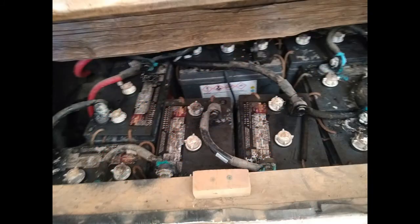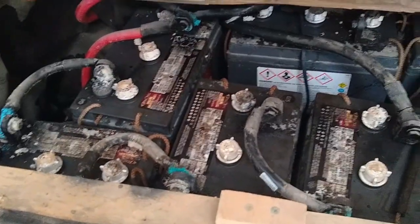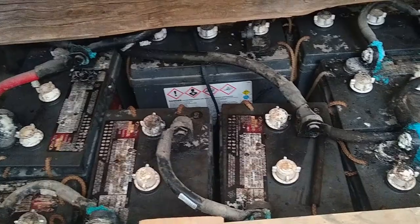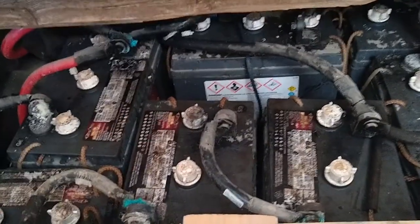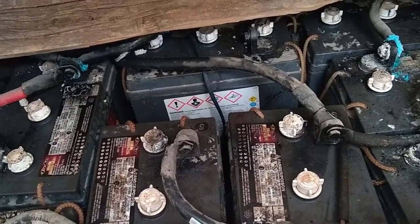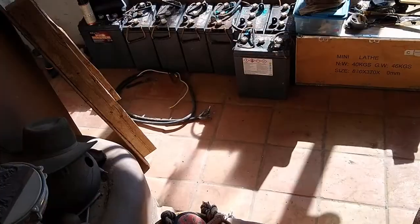This has been a long project, a bit longer than I anticipated. I wanted to get rid of these old nasty lead-acid batteries — got eight of these, making up a 740 amp-hour battery bank. Of course with lead-acid you can only really use half of that, so I want to get these out and replace them with lithium iron phosphate batteries.